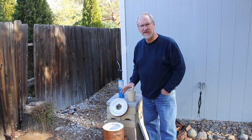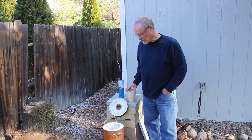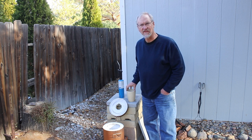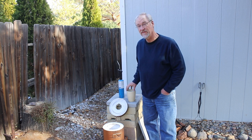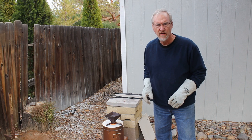We're going to light it off and let the iron do its job of displacing the copper in the sulfides, and therefore giving us a nice result with some good copper metal, just like we got on the other video, only this time with sulfides. Here's just a close-up view of the crucible looking down. You can see the glass that I put on the top there. I was hoping that the glass would form a slag and just kind of seal the sulfides in and minimize any smoke that came out.